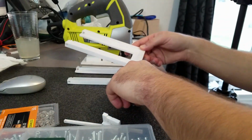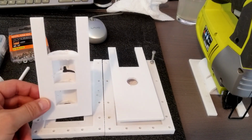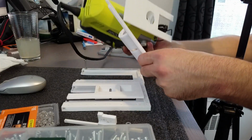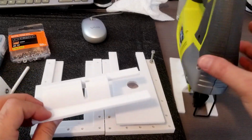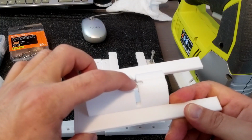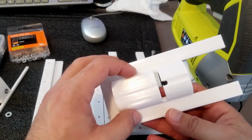Because I 3D printed a bunch of them and I kept on improving the design. If you look, some of them are larger, some of them are smaller. This is the latest model, and it has 2 holes on the bottom, and it's designed to be more universal than the original design, which has a smaller hole and started as a circle, and then we have this one which has a larger hole. As I fiddled with it, I kept on redesigning. So now you have the universal one, and if you have a secondary screw in your jigsaw, then you can drill this, but you can also use Meshmixer and add holes or cutting planes to create a second groove if you want to rotate this at a certain position.